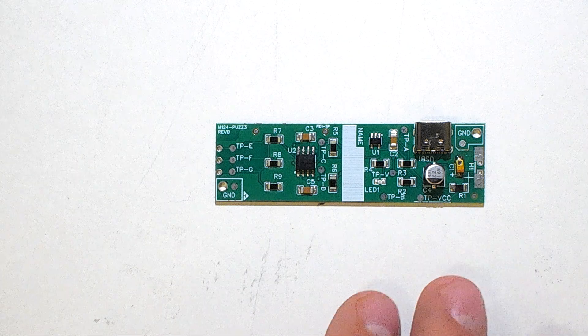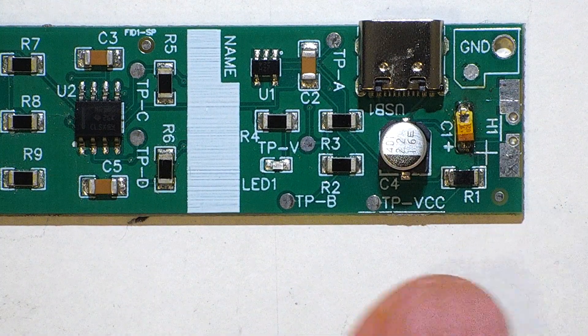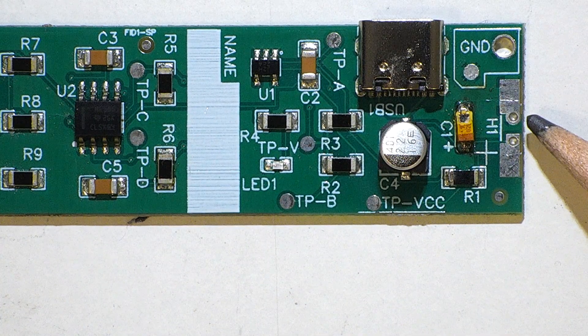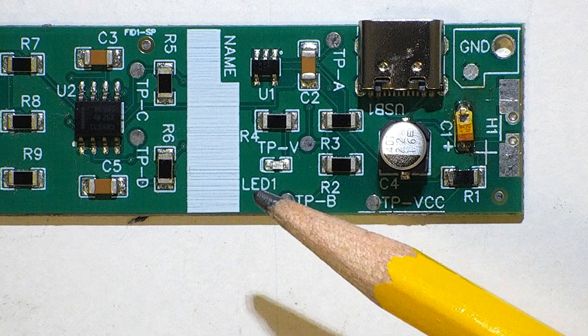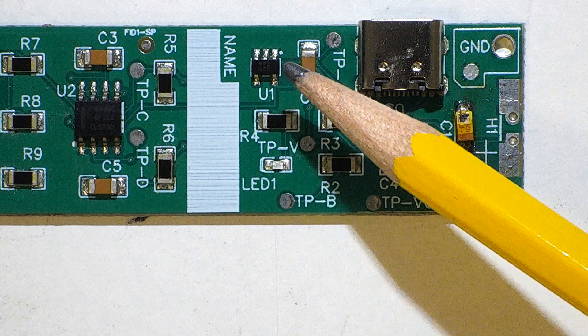If you're looking at a circuit board and there's a giant bug that has crawled into the circuit board and fried itself on one of the power chips — where do you think the problem is? Here I've got a circuit board, a relatively simple one that we designed. On the right-hand side we have a USB port that can also connect to a couple of pins. Through a couple of filter capacitors and a current limiting resistor that acts like a fuse, 5 volts is meant to pass through to a voltage regulator chip.